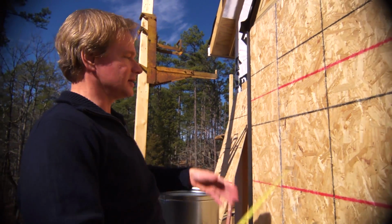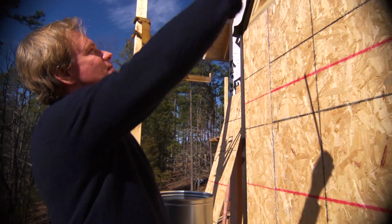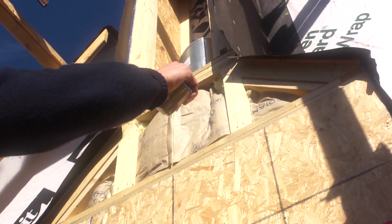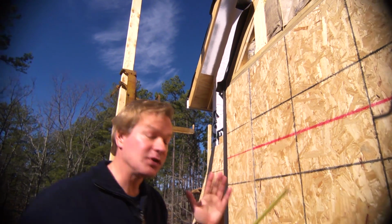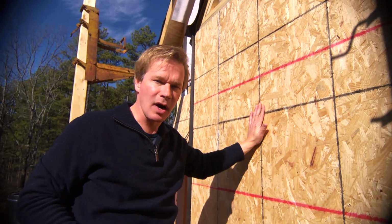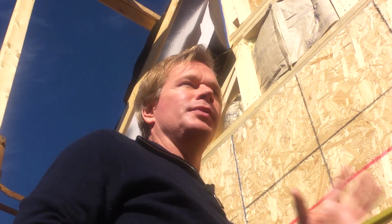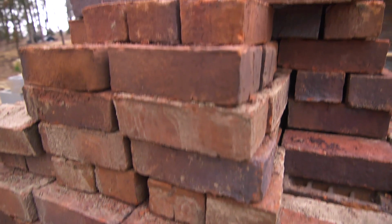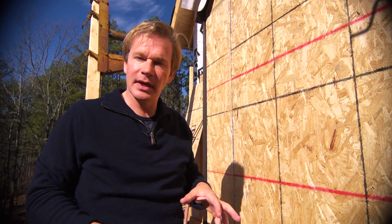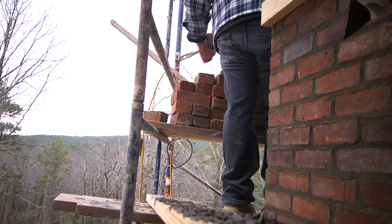But what happens is this 2 by 5 space suddenly comes in at those 45-degree angles that you can see there to the width of the chimney, that's 3 feet. Now this will all be covered in brick. Marcus is going to be here and he'll do a brick veneer with a beautiful brick that is made to look like an old brick. It's not a handmade brick, but it's made in a wooden mold, so it's got irregularities. It's really pretty cool looking.